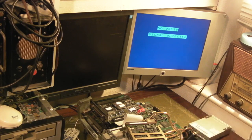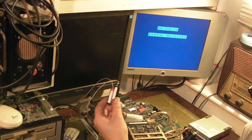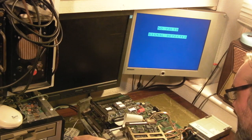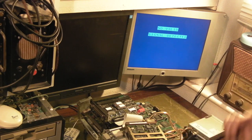I was originally torn with the idea of putting that AdLib sound card I built up in this, but I'm going towards the idea of perhaps putting a Sound Blaster clone with an actual game port so I can use a gamepad. Unfortunately I don't really have enough expansion slots to run the SCSI card, an AdLib card, a network card, and a game card - I've only got 3 ISA slots. Anyway, I'm going to leave it there. I hope you enjoyed this little update - to reassure you I didn't brick the thing. We are making some progress. We can now save our CMOS settings using that little battery hack, but we do have further problems with the real-time clock and the floppy drive issue. That's all the fun of working on these very old systems. Thanks for watching and goodbye!